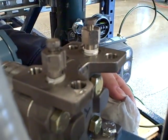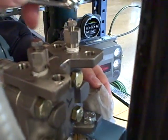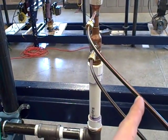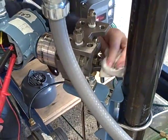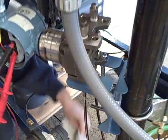This is done with the system in operation with the pipe under pressure to make sure we have a supply of water inside our venturi tube to continually fill the impulse lines as we bleed them from the transmitter side. That's a very important step when you're setting up a flow measurement system — to make sure the impulse lines are properly bled so we do not have air bubbles inside the impulse lines, which would cause flow measurement errors.